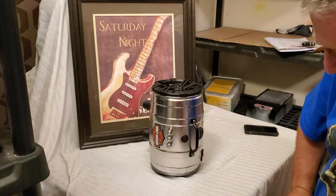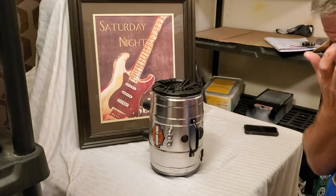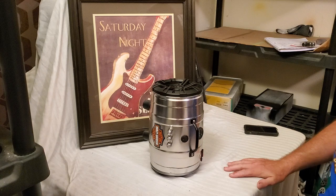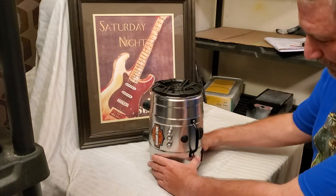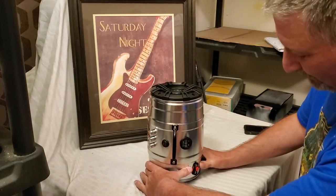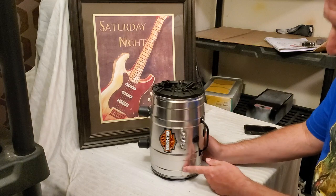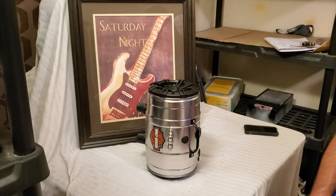So I came up with an idea. I went to the hardware store this evening, and I'm gonna take a piece of wood and make like a U-shape in it. And I'm gonna put some foam that'll cradle around this on both sides, like half circles, and will hold it steady, but it won't crush the aluminum. It'll spread the pressure out instead of just on one point. And that'll stop it from denting, because I know that it doesn't look too good.